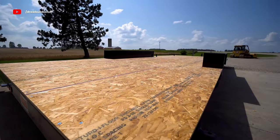With the first piece here, I'm just marking a 1-inch tick and then cutting this up on only that lower bent over section. Then I can score this tab with a knife and just wiggle it until it pops off. And then using a square, I scored another line along the backside of the fascia, right along that 1-inch mark, and then just used a handbrake to bend that up to 90 degrees. And now that's a good little end cap that we can use to start our run of fascia.